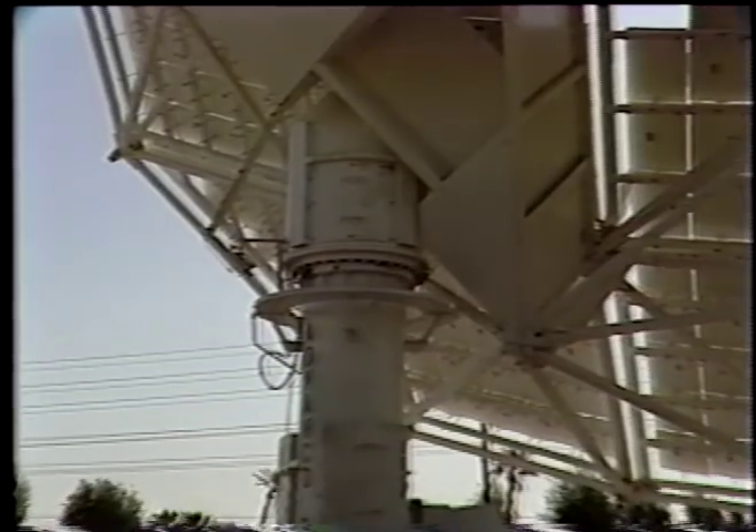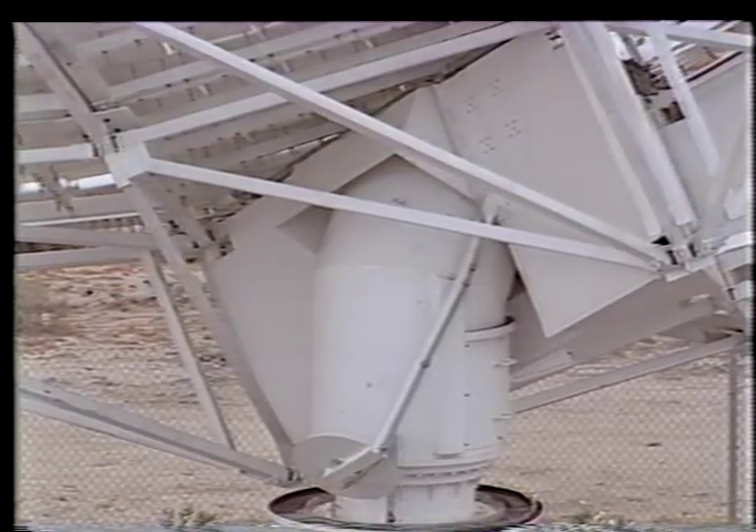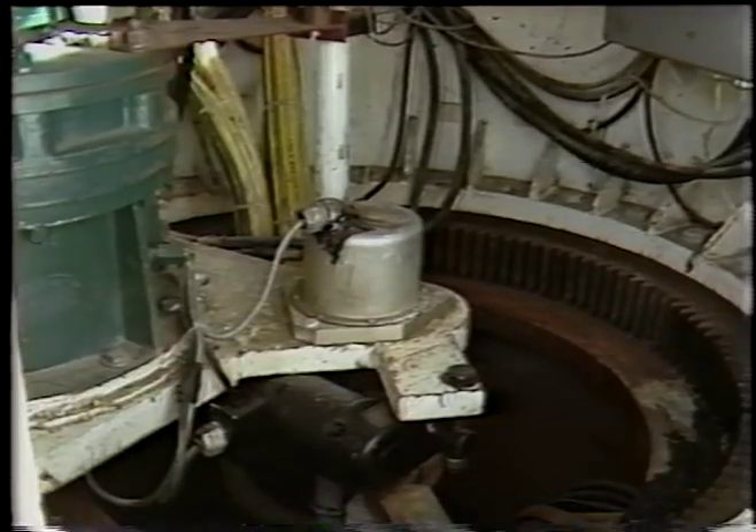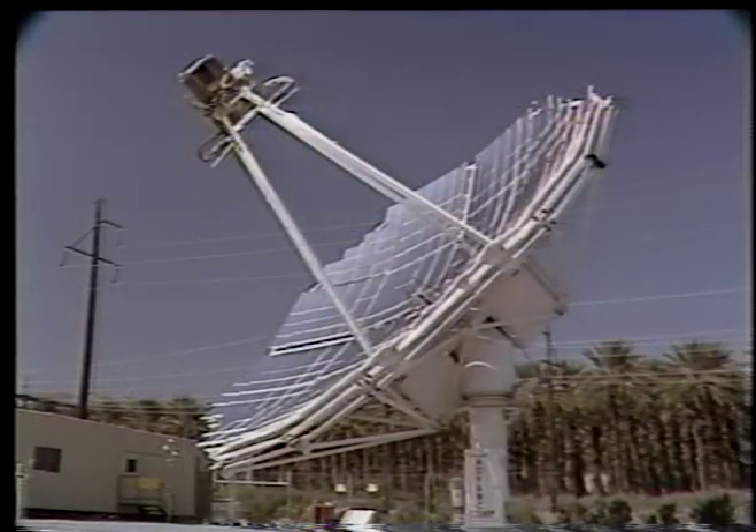The unique solution was the exocentric gimbal mechanism, or EGM. The EGM rotates rather than lifts the center of mass, maintaining the center of gravity in a horizontal plane. This eliminates the torque that would be required to lift the eight and a half tons of equipment, including the three-quarter ton engine cantilevered at the focal point.